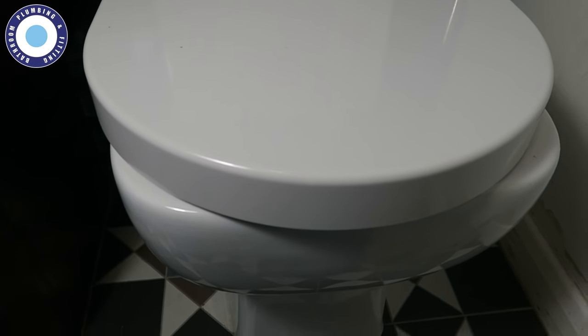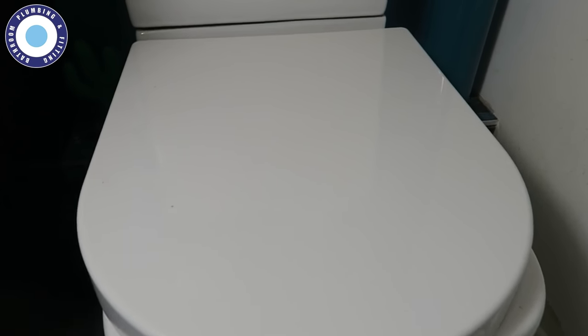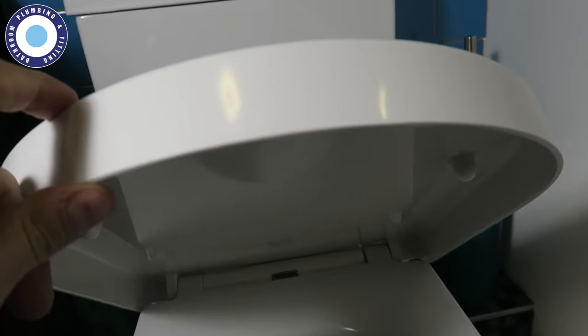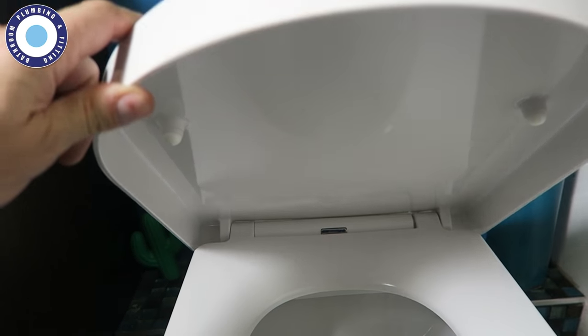So the first one is just down here. Here's the toilet seat — if I just move it you can see it's moving in a way it shouldn't. I think it's been replaced relatively recently; you can see by the shape of the pan and the seat itself this is a replacement seat. But there's a certain amount of movement. If I lift this up you can see it's moving all over the place, sliding from side to side. I can see that this point is stationary, so it's pivoting on that side — that's the side we're going to have to secure. There's no entry inside; I cannot get to the seat from underneath, so I'm going to have to do it from above.